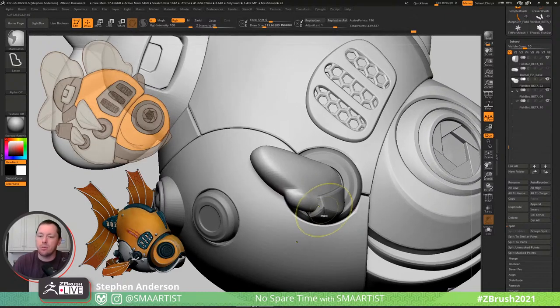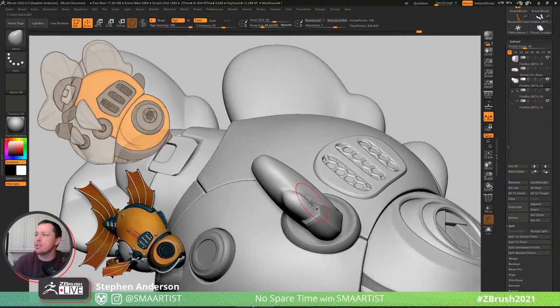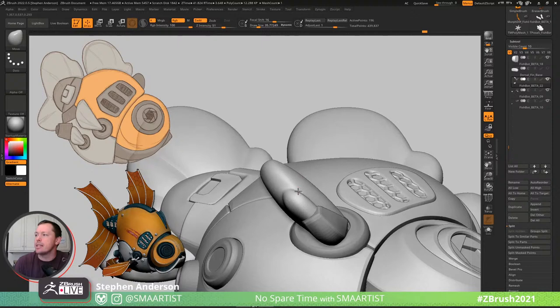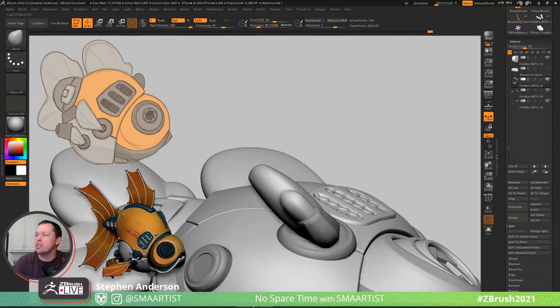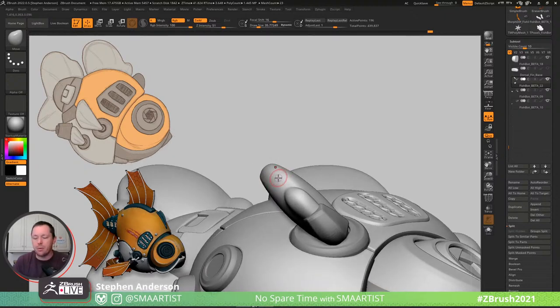Do you plug vents afterward? I don't. I'm not the most well versed with casting. It's something I'm still trying to get into. But my understanding is that vents don't get plugged, that they just stay open, and then anything that comes through, you just trim off. There'll always be something that comes through the vents, and that's fine. The reason the vents are there is so that they allow air to escape, so you don't get air bubbles. Hopefully.